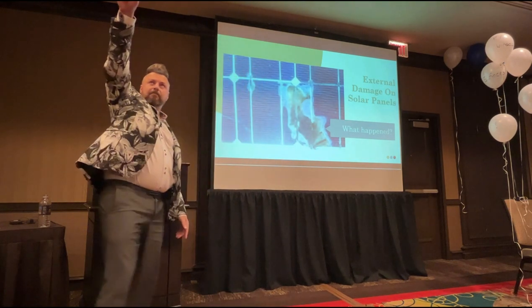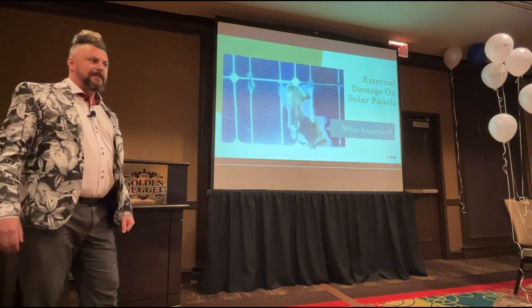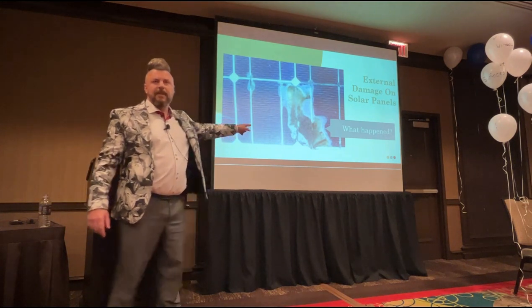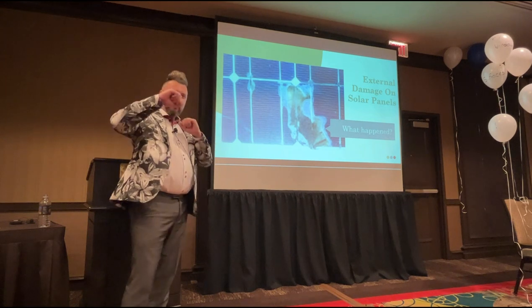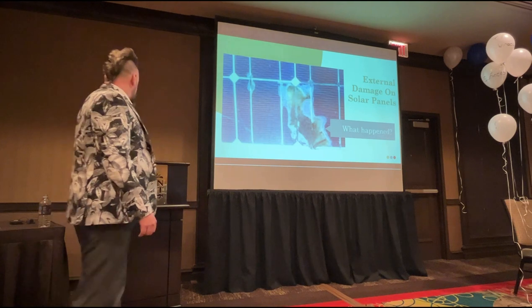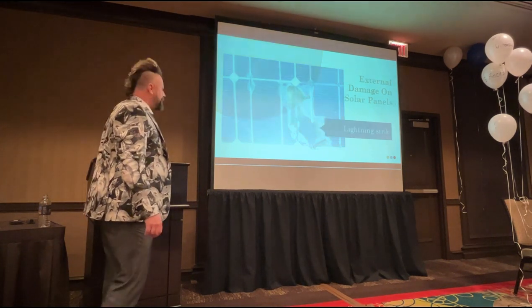So let's imagine that I'm at ground level and that panel is two stories up and I've got a 45 foot pole in my hand and I'm working away. Am I going to see this? You're not going to see that. What happens to me if I've got a carbon pole in my hand and I'm spraying water onto an open live PV panel? Zap. Yeah, I'm going to get a bolt. So, that one is a lightning strike.